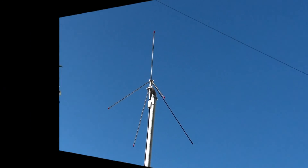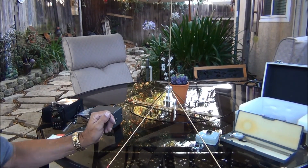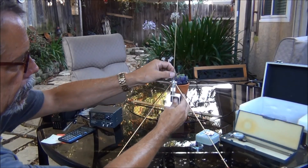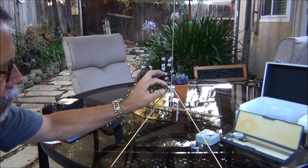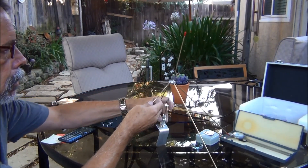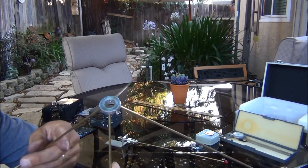Let's get to it. Before we get started, I'm going to show you how this is made. Basically, the antenna is just a PL259 with a brass rod put into it. And then these radials — I've made this little bracket to attach them. So I'm going to go ahead and take this off to show you. This is the radial ground radial assembly.